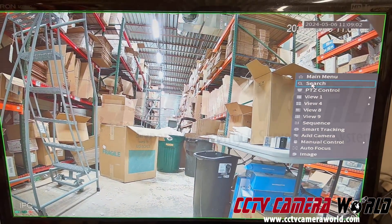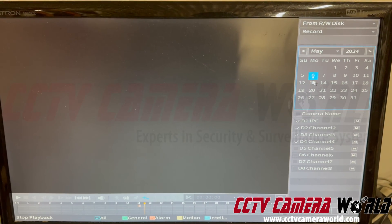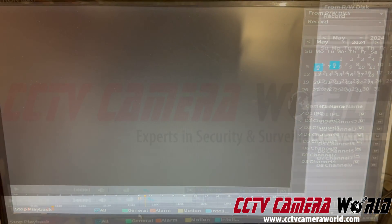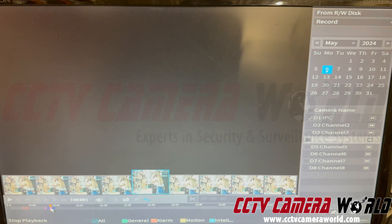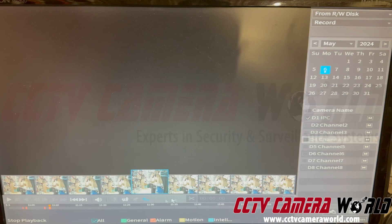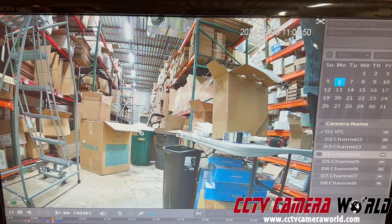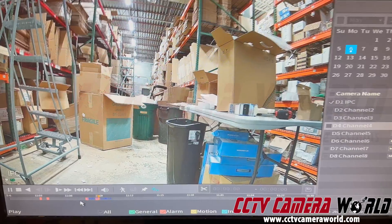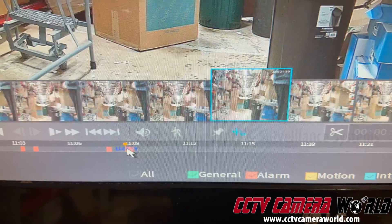I'm going to use my mouse to go into the NVR's search settings, select my day which is today — the date and time have to be set correctly — and select my channel. From the timeline I'll select the time. You can see that as I was speaking it was recording me and it appears right there. You can blow up the timeline and see it records for the time fragments the alarm was on for.